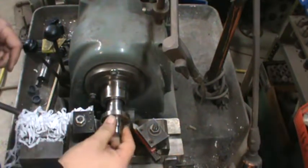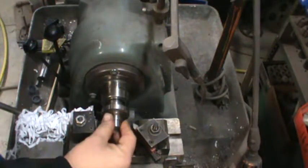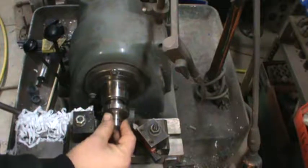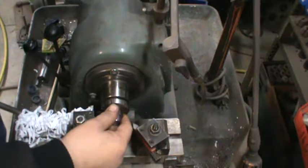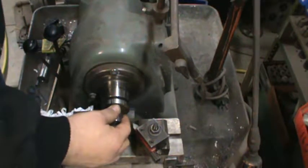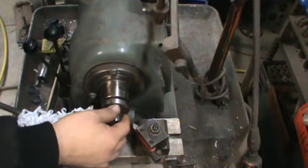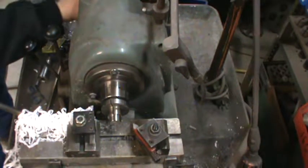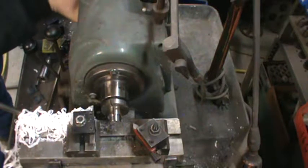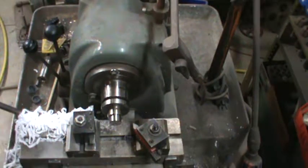I'm going to pop in the new collet with the expansion ring on it for the dark gray ones. Now, I notice that you've got a lot of inconsistencies in your dark gray parts as far as the depth. I'll let you check them out. You've got to tighten it until you almost can't get it, because the ID varies on your parts quite a bit. You've got to tighten them up pretty good. These were trial parts here, so we're still getting it set up.